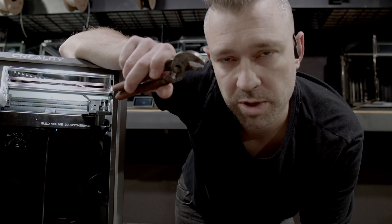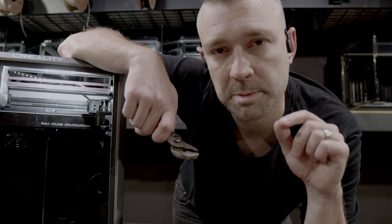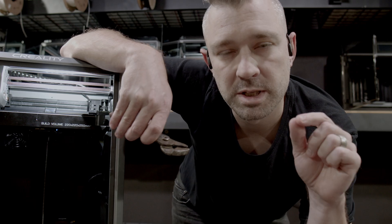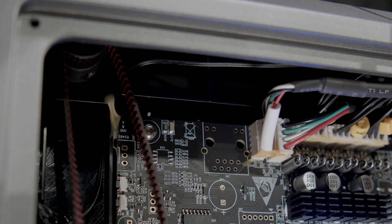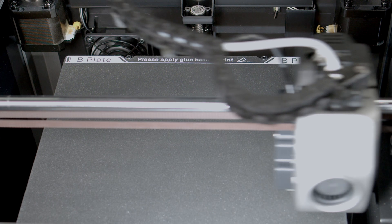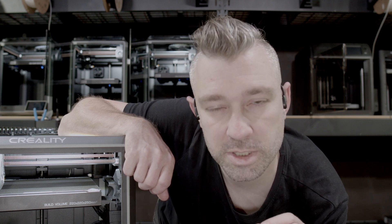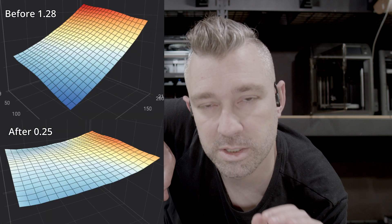You don't want to just put the pliers on there and start yanking. What you want to do is be patient and smoothly rotate them until you hear an audible pop — you'll feel it too. What this means is that the Z screw has skipped one tooth on the belt. We just keep doing this and run a bed mesh to see how far up or down we're moving. With method two, we were able to achieve a quick and dirty alignment of the Z screws, bringing our bed into a range of 0.25. Keep in mind when skipping teeth we can only get so close, but there are other methods to get the bed even more level. Using one of these methods, you should have no issues achieving a better bed level for your Creality K1 series machine.